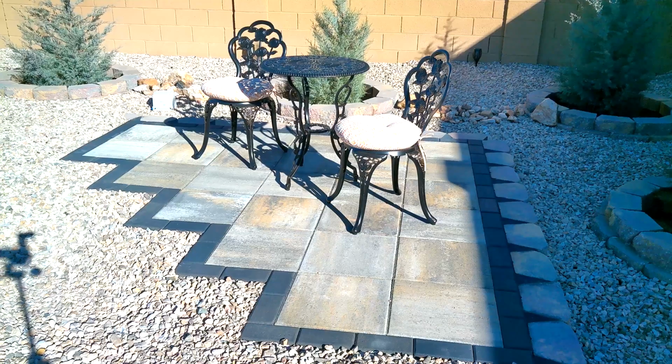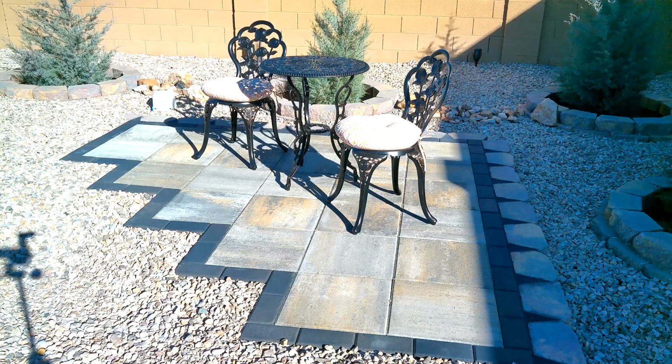And I did that a whole bunch of times, and then after that, when it rains, it's going to do it again. You've already got the strength of the paver sitting on top of it. Even before I wet it down, it already felt firm to stand on top of. When I did it, I put the pavers in place. I used a rubber mallet to pound them down in.